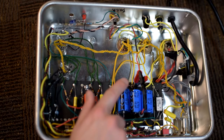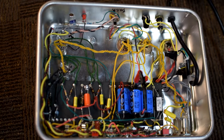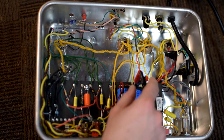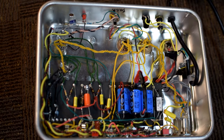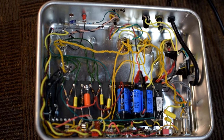And then, yeah, you just get one end of an alligator clip and solder it on, and another end. Now, I like to have two alligator clips. I would very, very much recommend you have at least one. And then if your other side is just an open piece of bare wire with some insulation that you can grab onto, that should be fine. And if you've got the right value resistor, it might take 5 or 10 seconds, but that's fine to just touch it on where it needs to go. But I personally prefer having two alligator clips to work with.